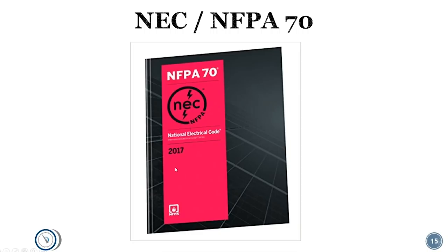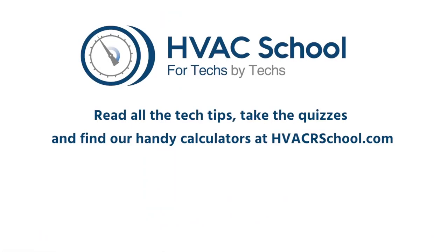All electrical installations should be made according to the NEC — the National Electrical Code — also known as NFPA 70, the National Fire Protection Association Standard 70. That's the Bible for proper electrical installations. Their goal is to prevent electrocution, prevent fires, and prevent arc flash, though arc flash is more so covered by OSHA. To sum it up: be very careful about not working on energized circuits, wear proper PPE — gloves, face shields, proper leather shoes — and understand that a shock could be well enough to kill you without necessarily tripping a breaker. Use all best practices to prevent yourself from being injured.